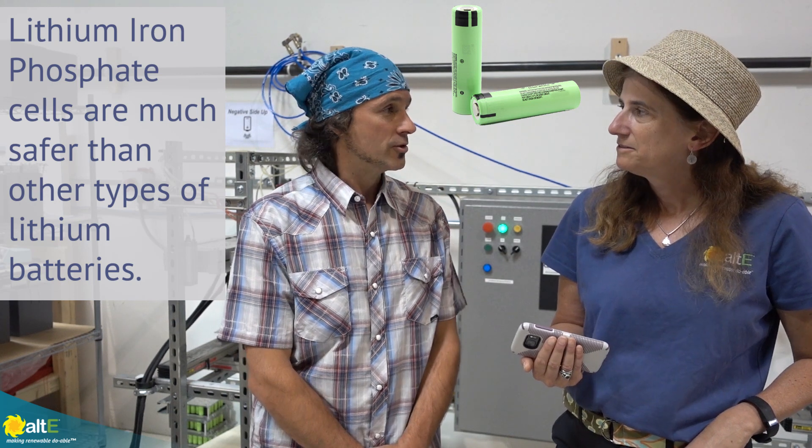Here at the Dragonfly manufacturing facility in Reno, we're talking with Evan, one of the co-founders and director of engineering. They make the Battle Born Batteries. This is a great facility. We've been here for about 15 months now, making good progress on production capacity and preparing for the sales growth we foresee over the next year or two. These are some of the automated welding systems we've designed and built in-house to take the lithium-ion cylindrical cells we use and weld them together into modules that get assembled into our deep-cycle battery packs.